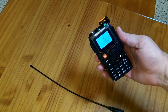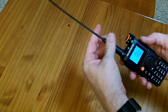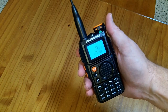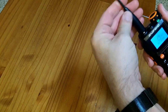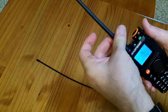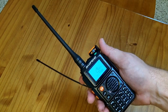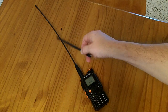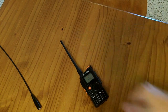The weather radio signal is strong enough that you don't even technically need an antenna to hear it, although it gets a little fuzzy. During the antenna comparison, I'm really not detecting a difference between the high-gain and regular antennas on this powerful transmitter. However, I found that for the FM band, the regular antenna actually works better than the high-gain antenna — the same station is much clearer with the regular antenna on FM.